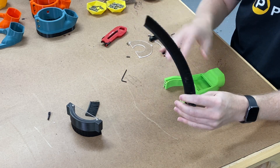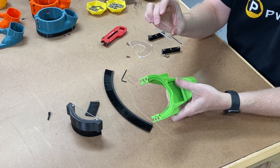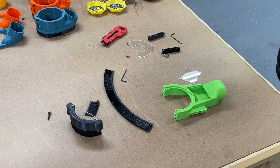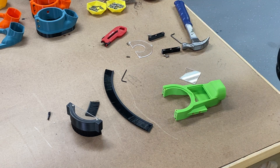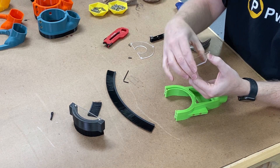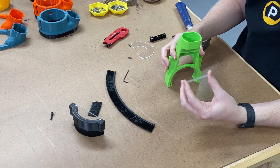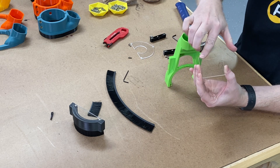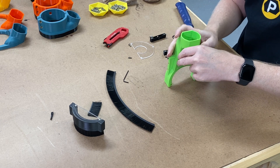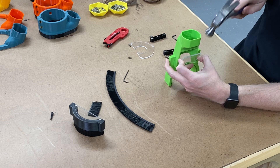Setting the face piece aside, I've got my boot. We're going to do the same thing, but let's start with the window piece — that one may require a hammer, let me grab one. I've taken my paper off from the acrylic. I've got my boot piece here — I'm going to set it facing down. Take my acrylic part and gently set the tips so the curved part goes down, setting those two corners right into the tip of that window area on top of the boot. I'm going to slide it back and if needed, gently tap with the hammer.